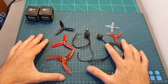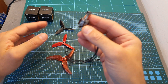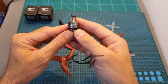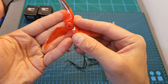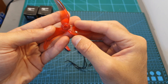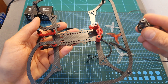I'm still not sure which frame I'm going to use with this motor. After that, I bench tested the 1408 motor using 3 and 4 inch propellers on 3S and 4S LiPo batteries. As you're about to see, using 3 inch propellers it could handle 3S and 4S very well. However, I smoked this motor on 4S using a 4 inch propeller — I kind of knew it was going to happen, but I wanted to push it to its limit to see if it would survive.